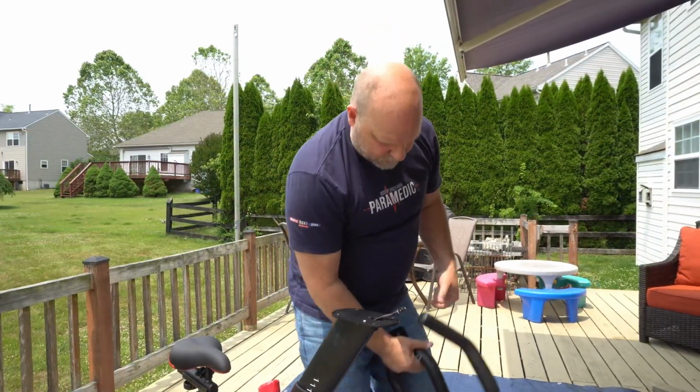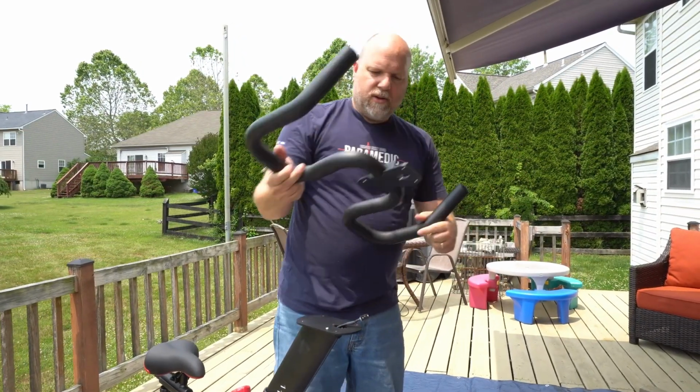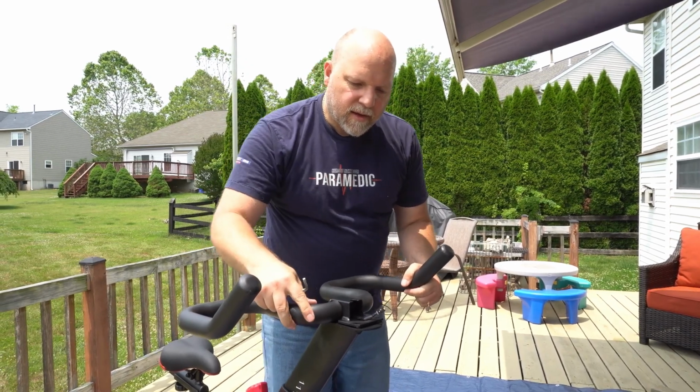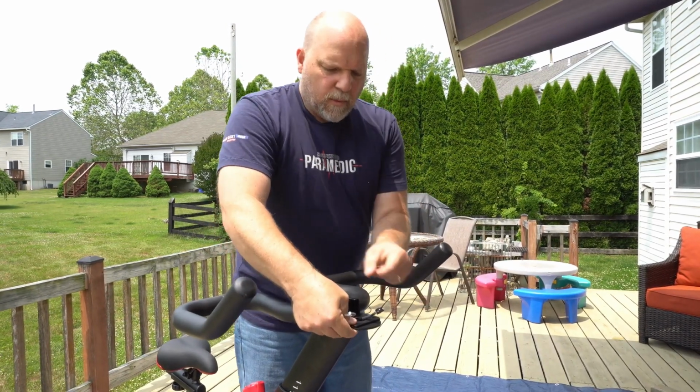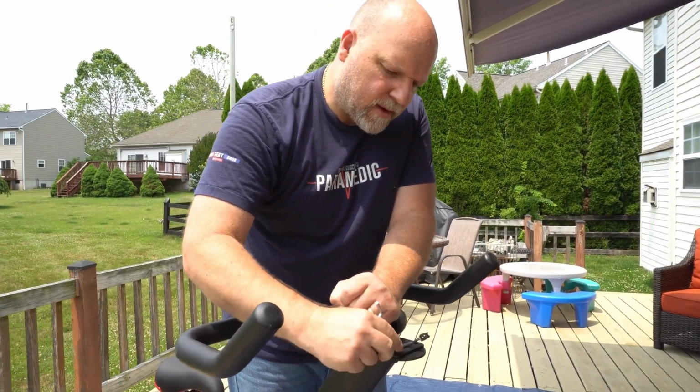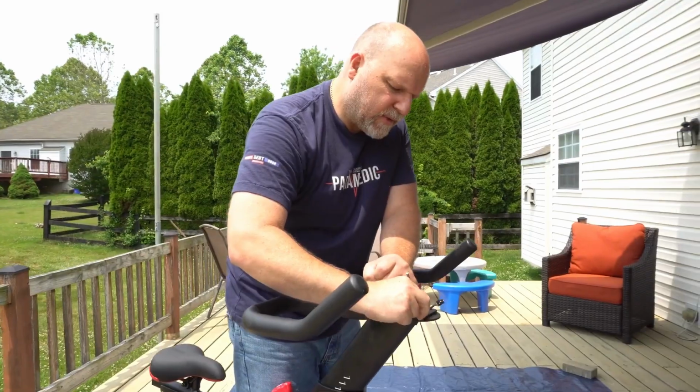And with them putting the bolts in it like that, you don't have to worry about the holes. You don't have to worry about it getting full of powder coat and trying to re-drill it or tap it, which can happen when you powder coat things.